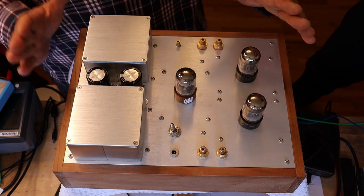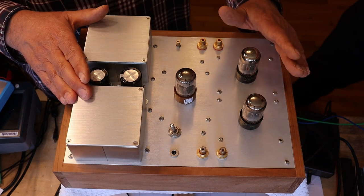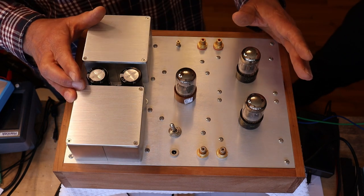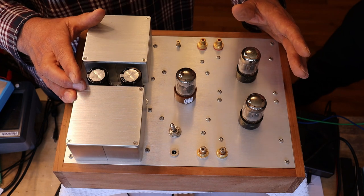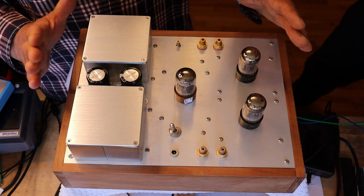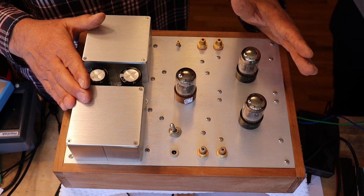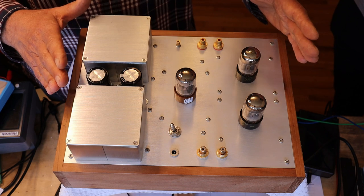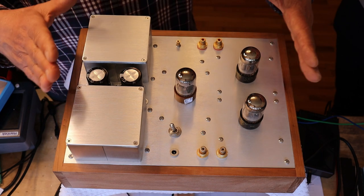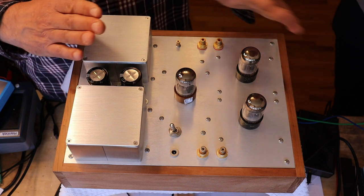And then the noise floor. The gain of this circuit without the EQ in is roughly 750 times. The EQ drops that down to, I think, 250 times? Somewhere around there. So keeping this thing as low noise as possible was so important. If you turn up a phono preamp, you're never going to be as quiet as a solid state unit. That's just a given. The main thing is you have groove noise when you're playing vinyl, and you want the noise floor of your unit below that. You can't hear it while you're sitting in your listening chair, and we reached that.